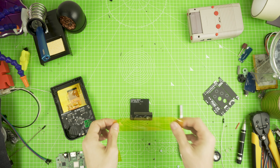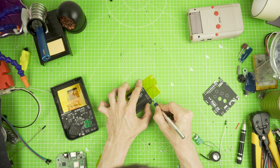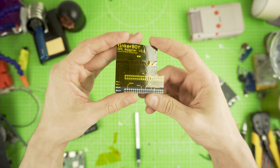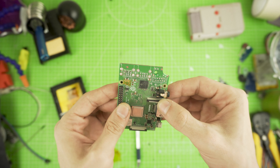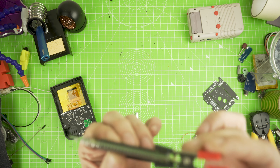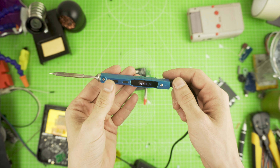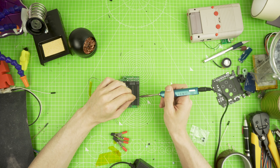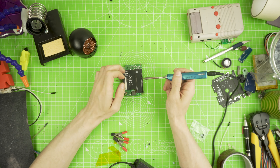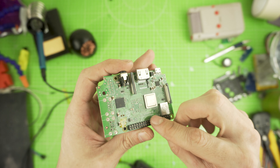Next we can go to our DPI adapter. Cover this with Kapton or electrical tape — this will ensure that we don't have any shorts. Cut the tape with an X-Acto knife. With the DPI and Pi 3 prepared, let's bring them together. To make sure that you get a flush fit, use two clamps to hold the two boards together while you solder all 40 pins. Please take your time — don't rush through, as if this is not done properly you will not have an image on the screen or worse. Once finished, it should look something like this: no cold solder joints and no blobs.